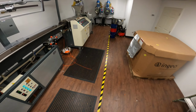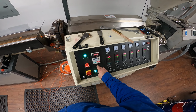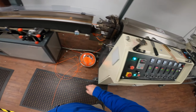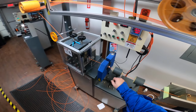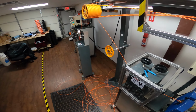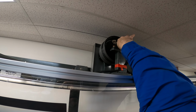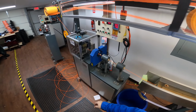Now I come down here, I up the speed to what I'm gonna run at for the day. And the alarm should start going off here soon. But I'll come down here and work on getting this in the range. And the accumulator's still spooling out, which it shouldn't. So I need to slow it down a bit, because I can't really waste too much filament there.